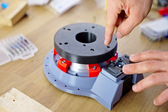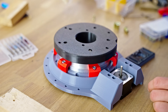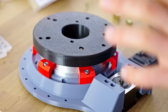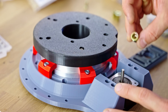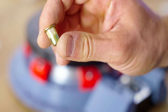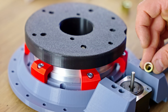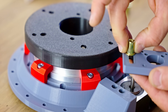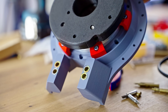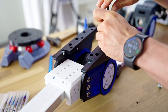This is going to be the motor mount for the base axis — this motor goes here, sticks out, and there's some adjustability there. I thought I had all the CNC kitchen inserts, but the largest ones I have are M5 and this is designed for M6. This is one of those situations where if you know the rules, you can bend the rules. Typically I wouldn't use rivnuts as a threaded insert, but in this situation, because we're not seeing any forces that would pull them out and because the flange actually supports the motor mount, these are actually perfectly fine. You came here for a 9-axis robot arm, so let's actually get this thing moving.